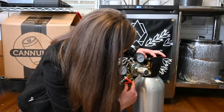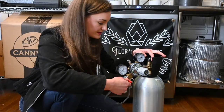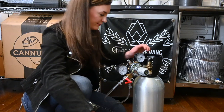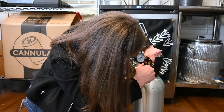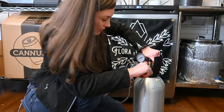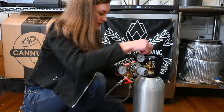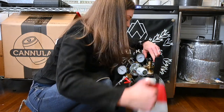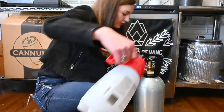I'm going to make sure all my valves are closed first. You want your valves to be closed because we want to check these fittings and connections with our Hudson sprayer — we're just going to see if we get any bubbles. You can also usually hear if you've got a leak, especially at high pressure. I'm going to turn this all the way to the left, which is off, to keep it out of this area. No leaks yet — just spray and make sure there's nothing I can't hear.